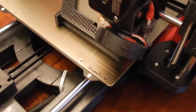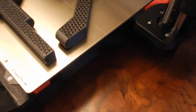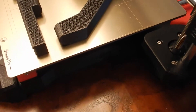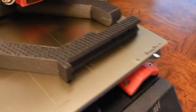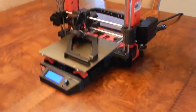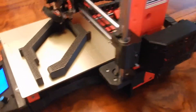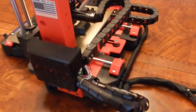The print quality is absolutely amazing — even better for objects like this than my Prusa MK3S produces by far. You can't even see layers, and that's at 0.2mm on a fast print with modified firmware. It's modified to work with my printer slightly — just the power to drive the axes and the axis length — but other than that it runs the Prusa firmware.